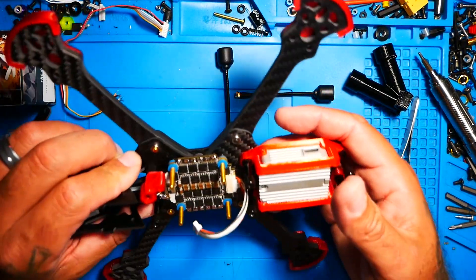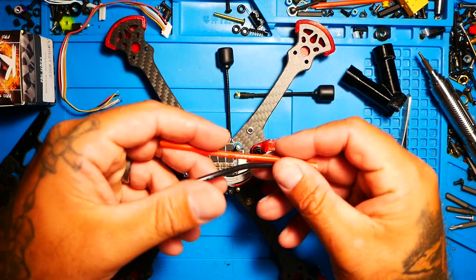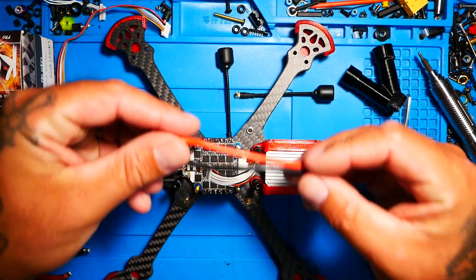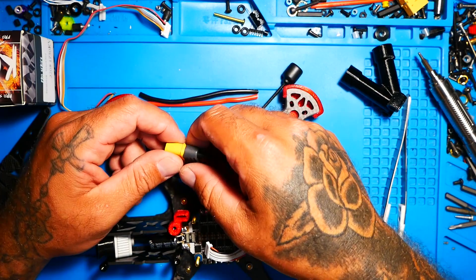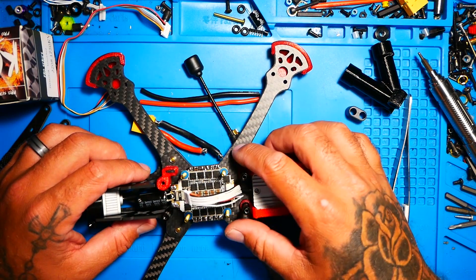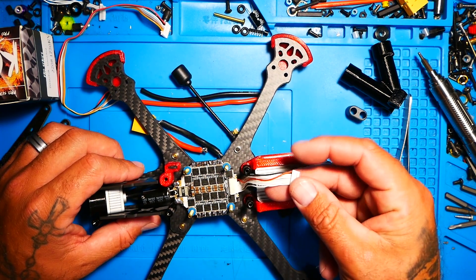Let's go ahead and get our XT60 wired up and ready to go. If you plan to use this little carriage here, note that you can't go above 14 gauge wire. I believe 14 gauge is going to be plenty with a 6S quad with 1750 motors. I'm going to desolder and solder those on, then get that wired up. Before we get too far with our XT60 lead, we should make sure we've got our wiring figured out for our harness, because we've got to power and wire our ESC to our flight controller.